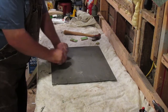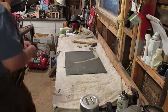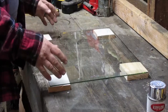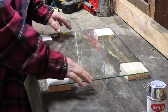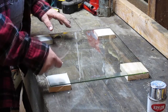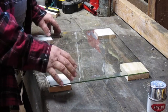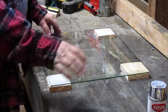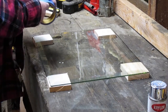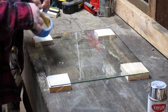To get this old backing off, I'm gonna use a razor blade and just start scraping it. It's not easy to scrape off; it's gonna take a while. Now that it's completely clean, I'm gonna clean both sides. Even after scraping as much as I could, there was still some silver oxide left on there. I had to take liquid drain cleaner, soak it on the back, and then it washed right off. They also make a specific chemical for that, but I had drain cleaner and it worked great.